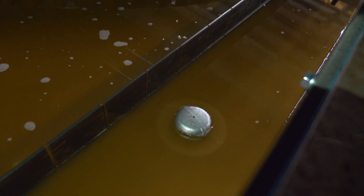Now that we know the plasma table holds water, we give it a nice scrub with some cleaner to get the dirt and rust out, and we're going to paint it so it's sealed real nice. It's metal, and if we don't do that it's going to rust aggressively — it's already got flash rust on the surface. Painting metal things is a must, and the paint will also help seal any tiny holes we didn't notice.